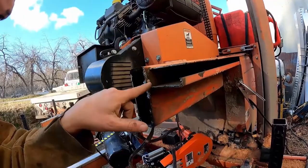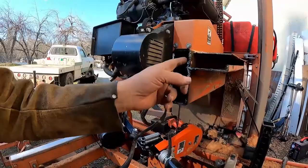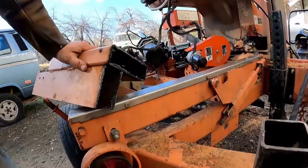Now we're going to grind these so that our piece of aluminum will fit. You see this bead in here from where they welded the pipe together? We're going to have to mill the piece of aluminum down to fit in there. First thing we're going to do is grind it out with the angle grinder and get it nice and clean on both sides. Then we'll see how close our piece of aluminum is to fitting in this.